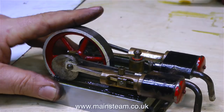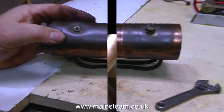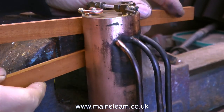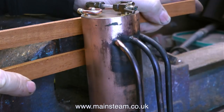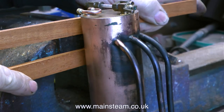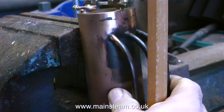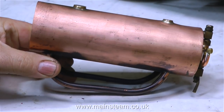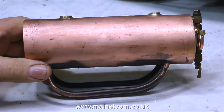It's time now to turn off the compressed air supply to the small engine — I think it's been running for long enough. So how am I going to fix this dint in the top of the boiler? Here's how I did it. As you can see, the dint has now gone. The boiler bush in the top of the boiler is threaded quarter BSF, so I fitted a quarter BSF bolt to it, then I securely clamped the bolt in the vice and carefully — and I do mean carefully — using two pieces of hardwood, I gently levered the boiler away from the boiler bush. I did this really, really gently and didn't put a lot of pressure on — I didn't want to create any more dints. After doing this gentle levering for a short while, there was a sudden noise as the dent popped out. I didn't video this process because I wasn't sure it was going to work, but to my surprise it worked quite well and the dent came out. It's not perfect, but it's a lot better than it was.